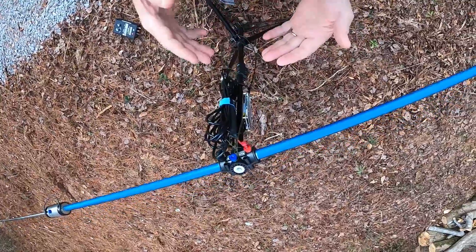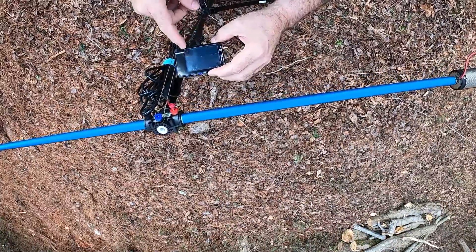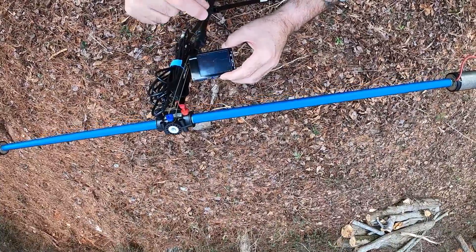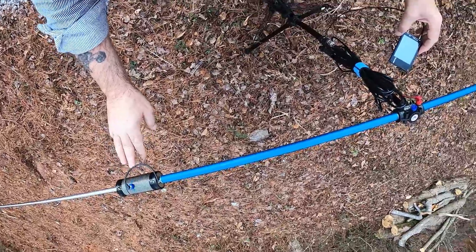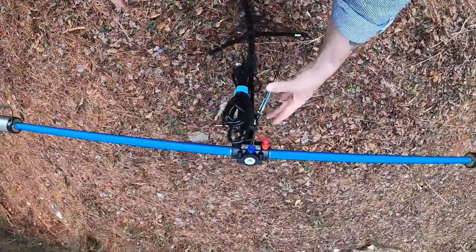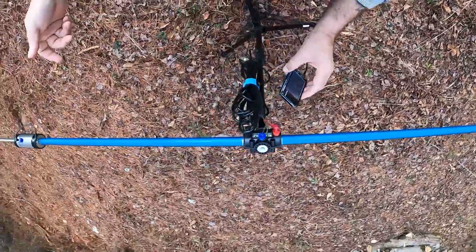I'm back. I really can't see the camera — it's above my eyeballs — but hopefully you can capture this. Looking at my analyzer right now, it's saying about 14 to 1 on the SWR. You can look at the screen and see there's a little hump there. Everything is teeny tiny on this thing. I've got these set pretty much in accordance with the way buddy pole says to set them, and so now to make the final adjustments, I'm going to pull in each antenna arm — the telescoping antenna — until I get the best SWR.